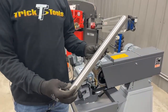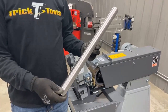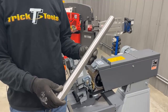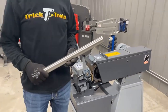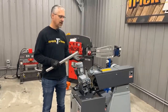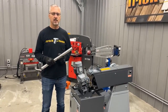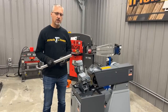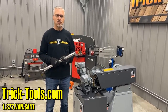You can see we've got a nice finish on this tube. A lot of people ask whether you can change the outside diameter of a tube with a centerless grinder — that's not really the intention. It's really just putting a finish on the tube, and you won't see much change in outside diameter, even measured with a micrometer. This finish was achieved using a coarse surface conditioning belt, but there are many abrasive options — finer grit standard abrasive belts, or surface conditioning belts that give a nice satin finish. Depending on your needs, there are lots of options. If you have any questions, call our sales team or check out tricktools.com. Thanks for watching.